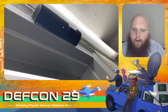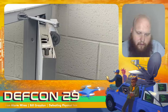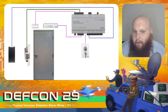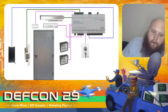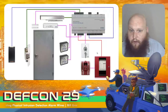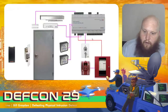Here's an example in the wild: a passive infrared detector mounted over the door and an in-frame door contact sensor that pairs with a magnet in the top of the door — when closed, those are together and it detects that. Other exploitable hardware includes a key switch telling the controller building open/closed hours, accessibility buttons (particularly on the secure side — pressing that usually triggers an unlocking sequence and disables the open-door alarm), and the fire system. When a mag lock is installed, a fire situation must unlock it by code so people aren't trapped inside. If we trick the system into thinking there's a fire, that will also unlock the door for us.